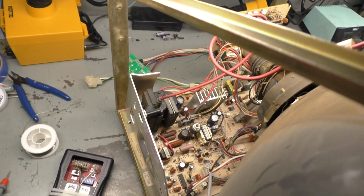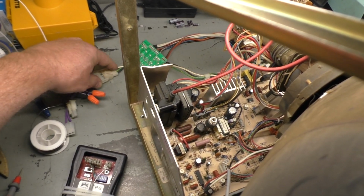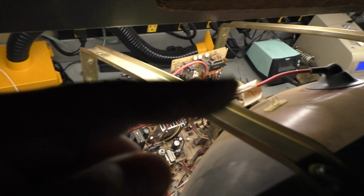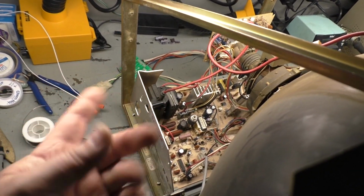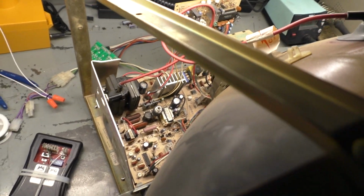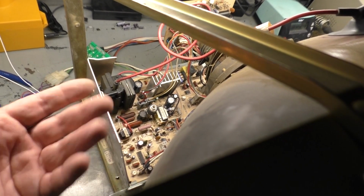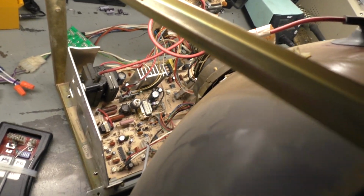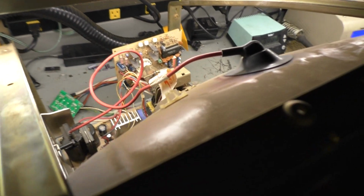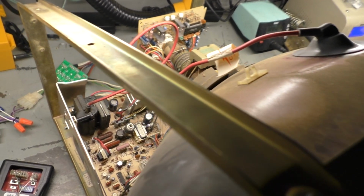Oh, I forgot to hook up power. Of course, it's the other way. There we go. Alright, so now we have anode, neck, yoke, ground, remote, power, video. Let's turn on the test pattern generator. I have the vertical connector hooked up the proper way, up and down instead of upside down like last time. So let's see, do we have blue? 1, 2, 3. Now that ticking is a flyback, but do we have blue? Yes we do!